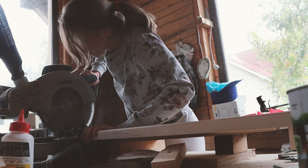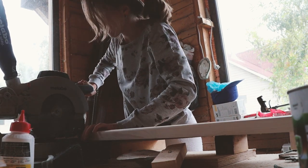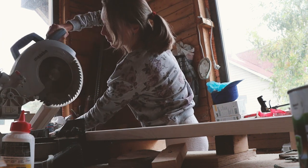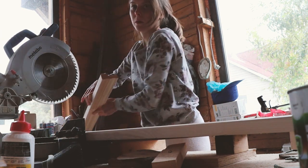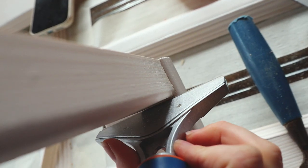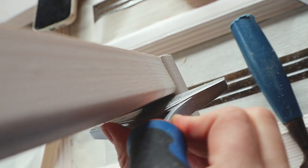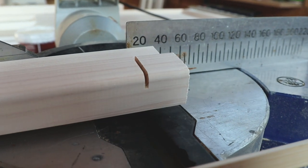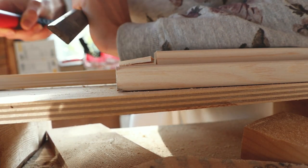The only thing left is to install the doors in place, and this is where the fun begins — I don't have a door frame and have to cut one from scratch. To make a door jamb, I first cut it into three pieces. To fit them together, I need to carve the ends of the two side jambs so the head piece can rest on top.